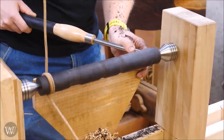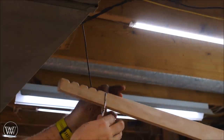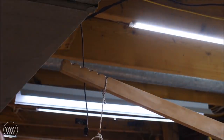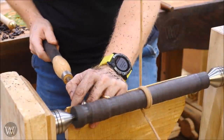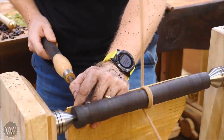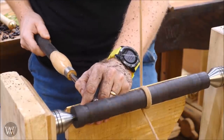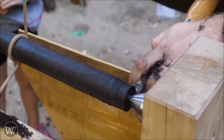What I want to do is ring down at several points until it becomes round — that gives me a visual cue for where round is. The next thing I need to do is adjust the pole so that the cord now runs in the middle of the work as opposed to right out on the end. This will allow me to work on both ends of it so that I can create two handles at one time. Then I can finish out the rounding and start working on the tenons.